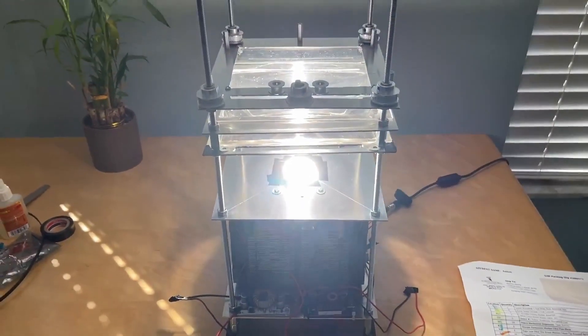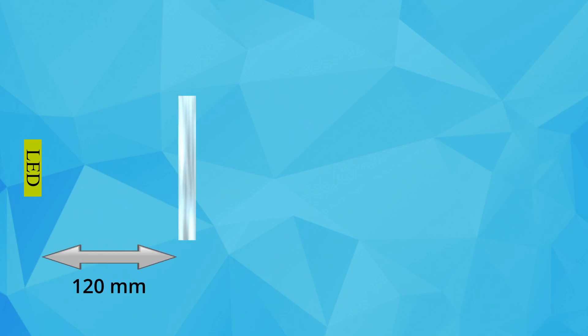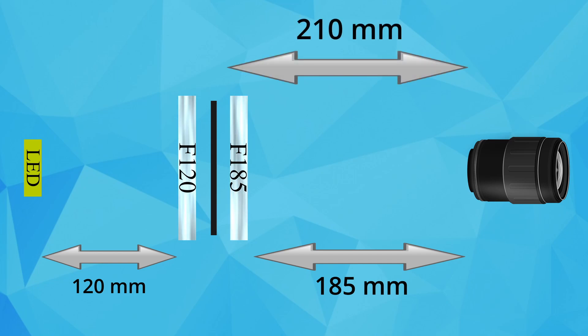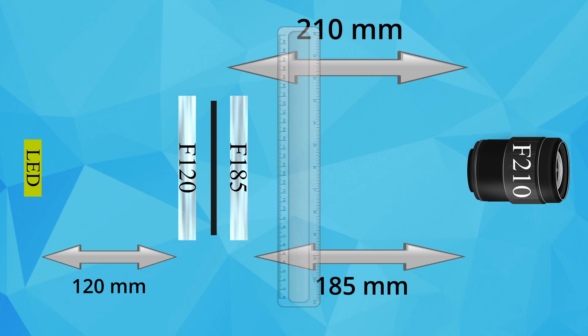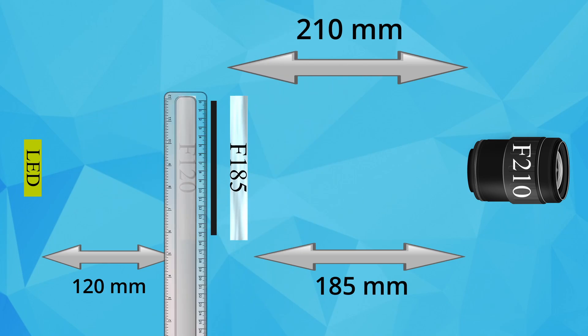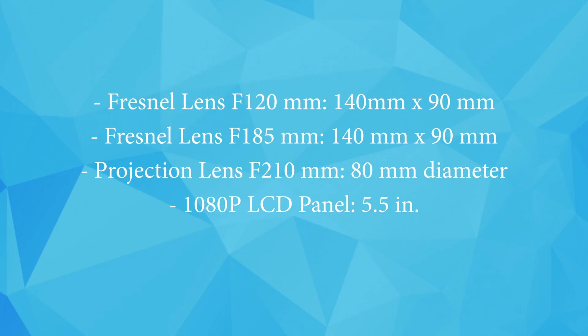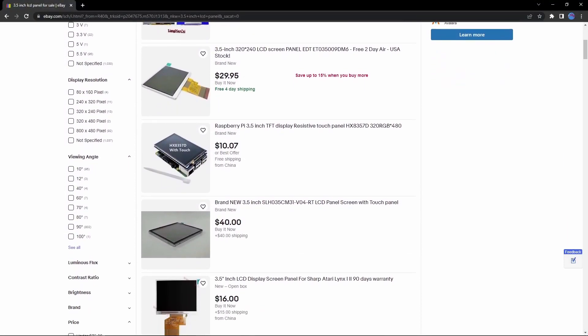After making sure everything worked, I tested the optical portion of the build. In the previous version, I had my lenses at inaccurate and undefined lengths from each other. Here's what I learned: one, the distance from the LED to the first Fresnel lens should be within 5mm of the Fresnel's focal length; two, the distance from the second Fresnel lens to the projection lens should be about the focal length of the second Fresnel; three, the distance from the LCD panel to the projection lens should be the focal length of the projection lens; and four, the Fresnel lenses used by a lot of DIYers are about the same size as the LCD they choose. Here are the focal lengths and sizes of the stuff I used — theoretically you could make the build more compact by using smaller sizes and focal lengths, but those parts are harder to come by.